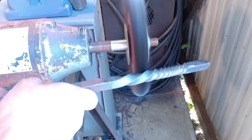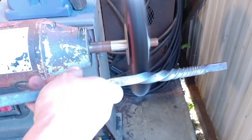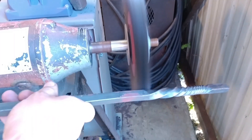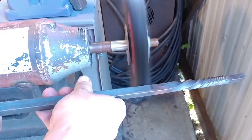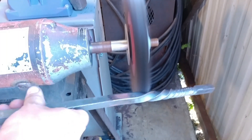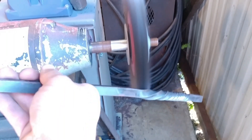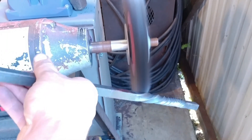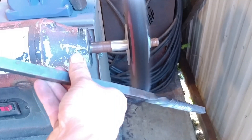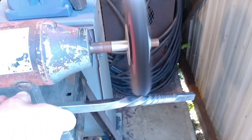As you can see here, I'm just cleaning this all up. You essentially just want to remove anything and everything that you don't want to be seen in your final product. Wire wheeling is a slight abrasive process, so in certain instances it's not the best choice, but it works very well on forged steel for the most part. As opposed to using a flat disc or sandpaper, you would actually have score marks that you'd have to clean out of the piece in order for it to look right.